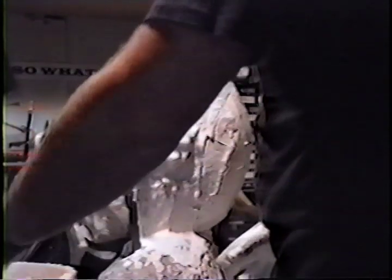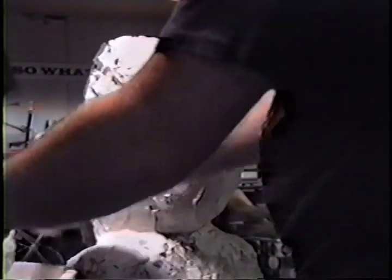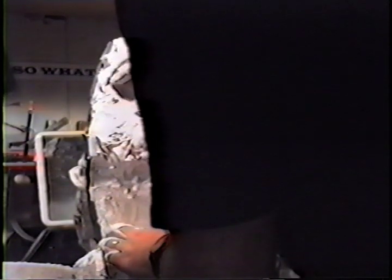I press these little swatches of plaster and sisal fibers into the areas. The first place I go is right around that wall. I cover the main areas, reinforcing, and keep going back. Stick the fibers — little swatches of fibers in the plaster — squeeze out a little bit, work it on. Another thing that's going to happen is that first layer is going to suck all the water out of the plaster you've got now. So stick it on there quickly, go quickly, press and work all the bubbles out.